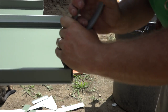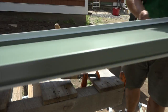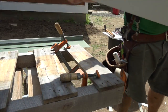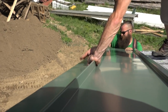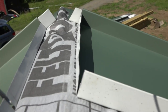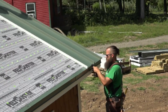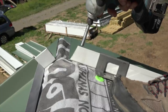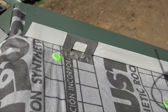This is not visible finish work - they don't have to be the prettiest things because they're buried underneath the ridge cap. Now they're ready for installation on the roof. The seams lock together, the left one locking over the right one, and Ben slides the panel up the roof to tightly lock into the drip edge. He crimps the joint with hemming pliers, and then Rick anchors the panel at the top with a screw so that he can fasten the clips along the seam without fear of the panel moving.